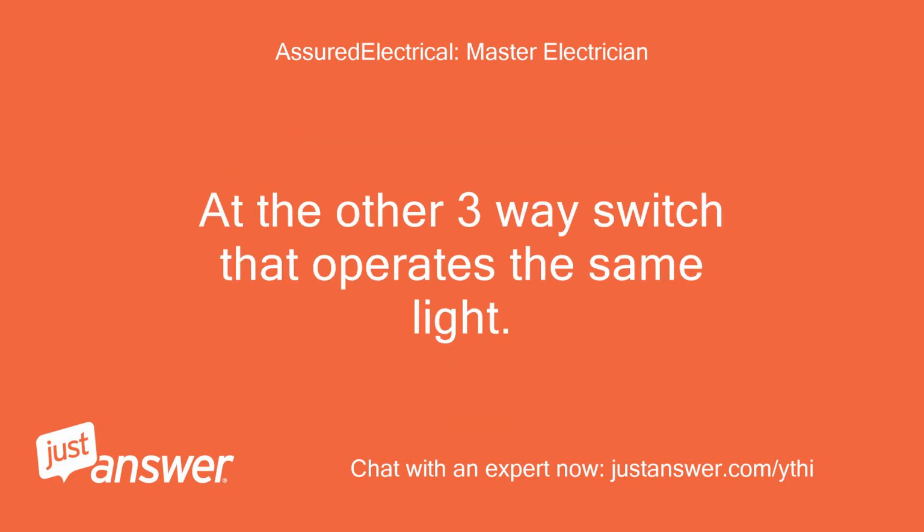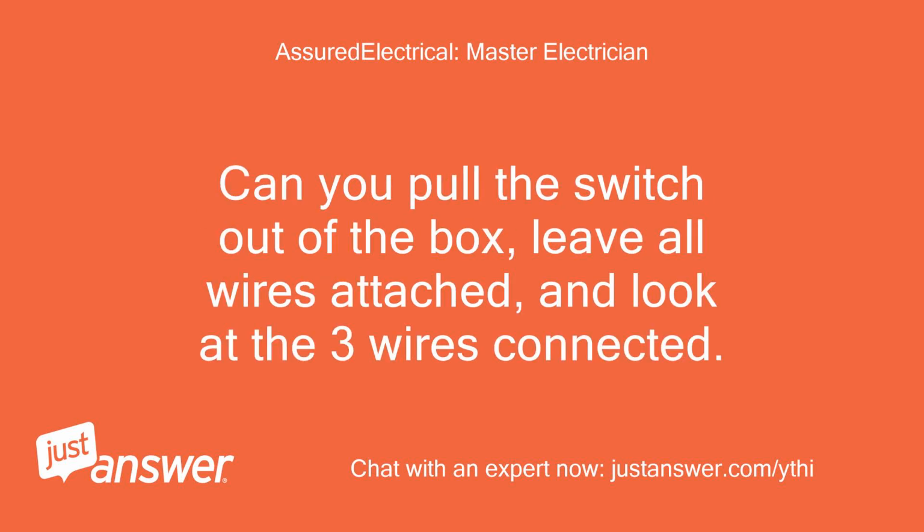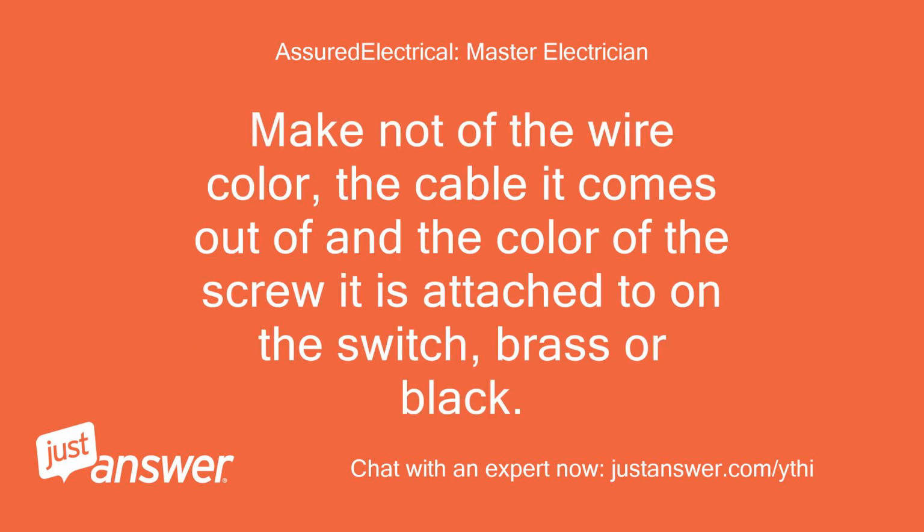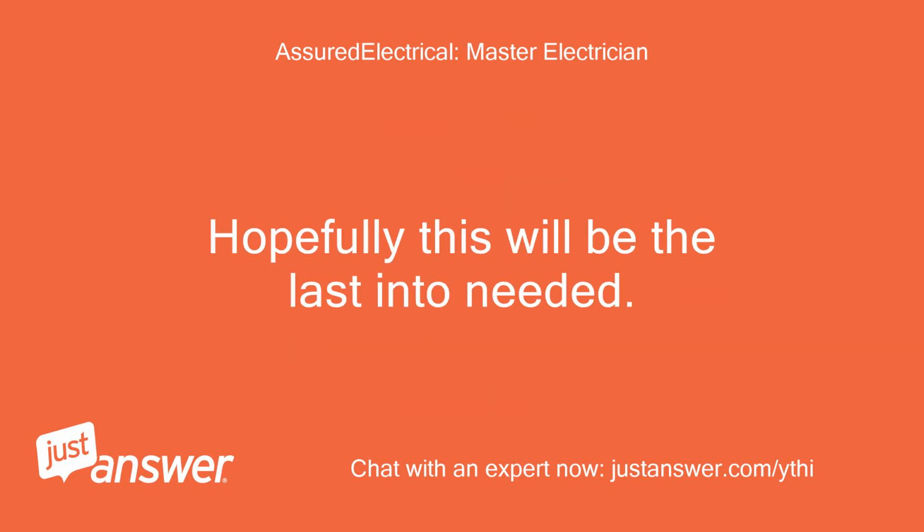At the other three-way switch that operates the same light, can you pull the switch out of the box, leave all wires attached, and look at the 3 wires connected? Look for the same information. Do all 3 wires come out of the same cable or different cables? Make note of the wire color, the cable it comes out of, and the color of the screw it is attached to on the switch, brass or black. Hopefully this will be the last info needed.